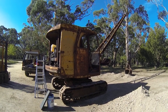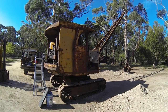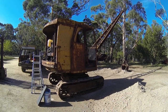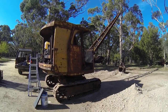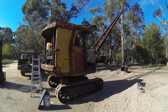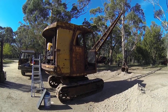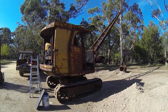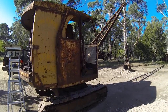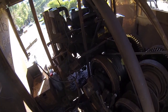Went through adjustments and they were okay. Asked a few people online and there were a number of suggestions with different types of material to throw in the actual clutches to potentially make them grab, but decided to just pull them apart and clean them and do it properly. So I'll show you where I'm at - the hoist drum itself...